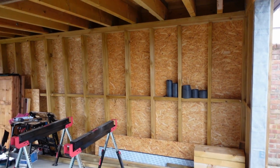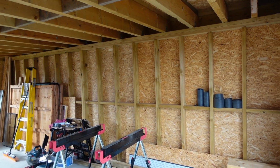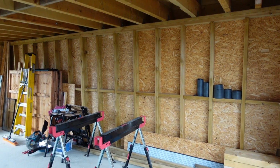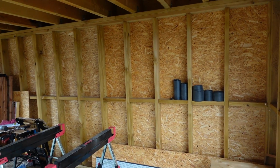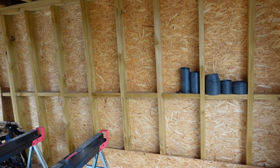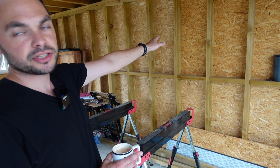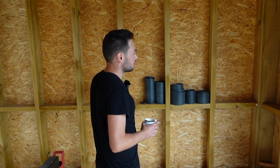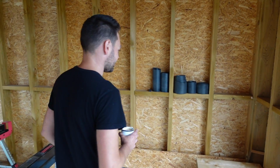And so talk us through what we've done here, because when we were speaking on the phone, we were talking about either doing it at 400 centres, or maybe doing what they do in America, which is at 450 centres to try and reduce waste. Yeah. What did you go for? We went for 450. Okay, so you're 450 on centre. 450, yeah, give or take. I mean, for me, you win some, you lose some, because it's going to be great for getting the insulation in, because every 3 bays is 1 sheet of PIR. So there's very little waste on that, which is good considering the price of it.